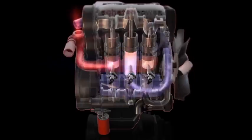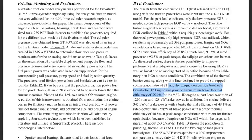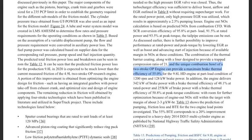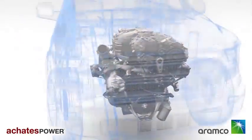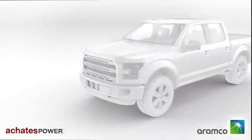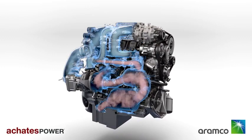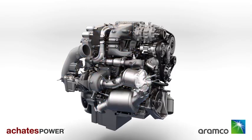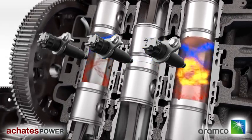Now, these efficiency numbers were achieved in 2012. Studies published in SAE as recent as 2017 have shown that brake thermal efficiencies as high as 55% are possible using 3-cylinder opposed piston diesel engines. So the next and most obvious question, will we ever see these engines in production vehicles? Obviously, adopting new engine technologies can certainly be a risk, but we just might see them in the near future, as reports from the 2017 Detroit Auto Show indicate that 9 automakers have signed on as development partners, and at least one of them has started to implement tooling for producing an opposed piston engine in greater volumes.